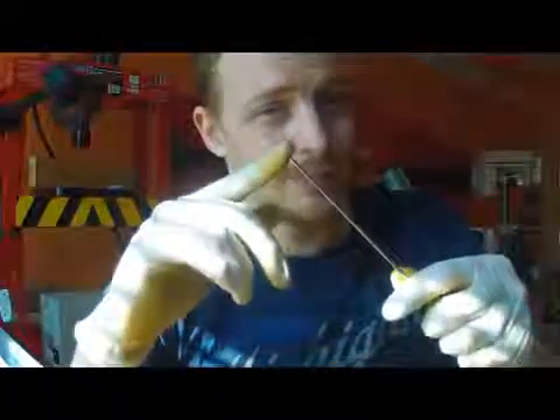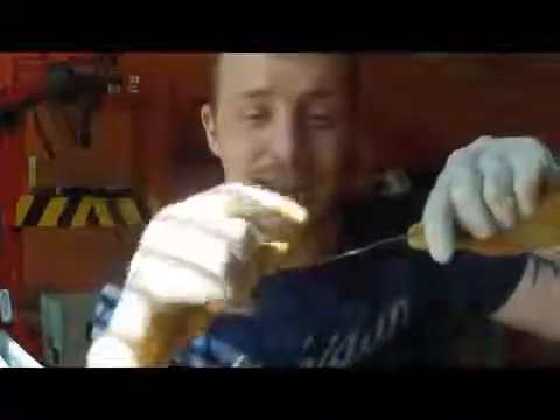As I showed you earlier, we have a jig. Some people want to anodize and they just hang the pieces on a piece of aluminium wire bent into a hook. It works, sort of. If you're using aluminium welding wire — which is not pure aluminium — what you'll tend to find is because it's got other alloys in it, you'll get a crustacean-like buildup along the wire which insulates it, stopping the actual piece from making contact and causing it to stop anodizing prematurely. Then when you put dye into it, it will fail because it hasn't anodized long enough.